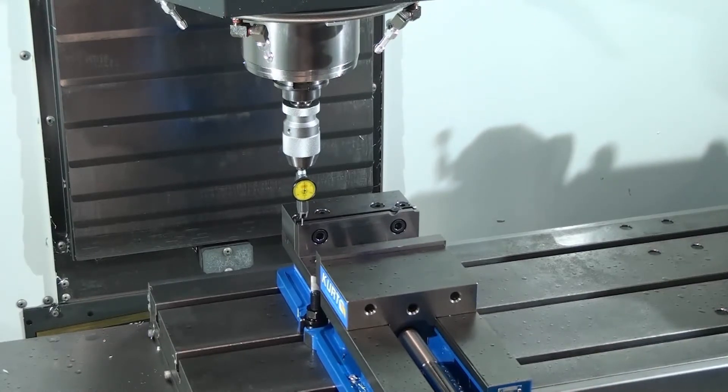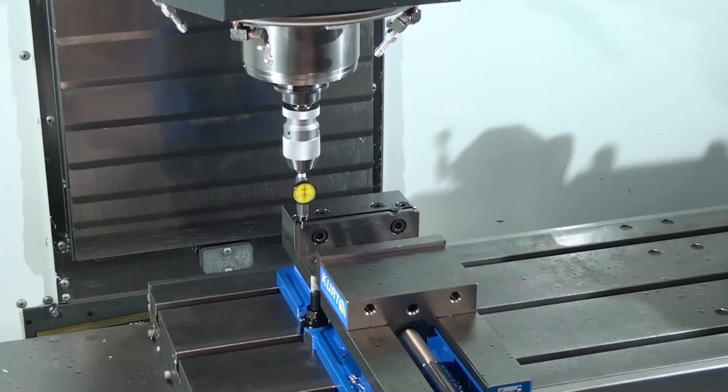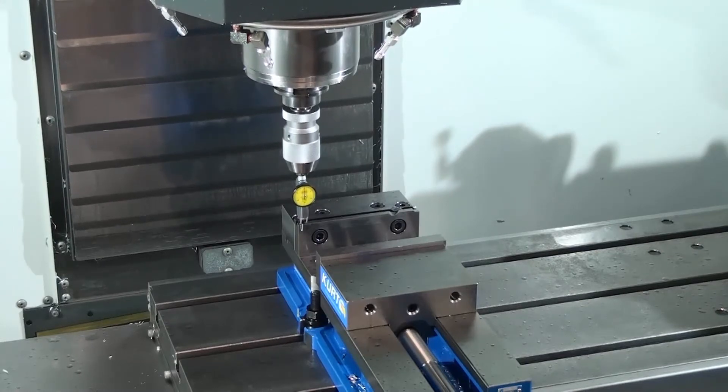You can see I just moved the indicator just a little bit — just enough to read. I'm going to have to bring the indicator down a little bit because I know I'm going to hit that rough spot on the other side of the vise. So I'm going to start right about there. I moved the y in using the 1/10th increment and now I'm set.